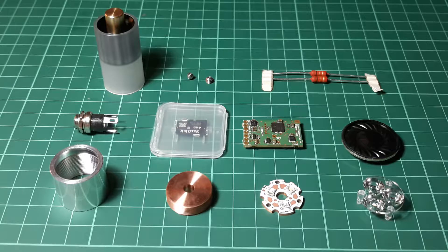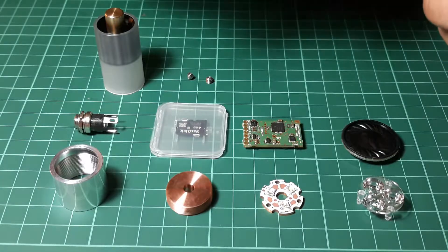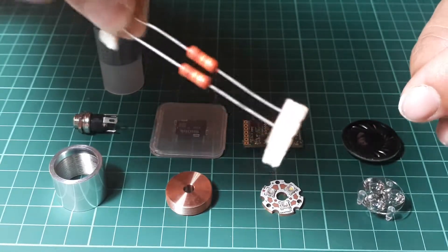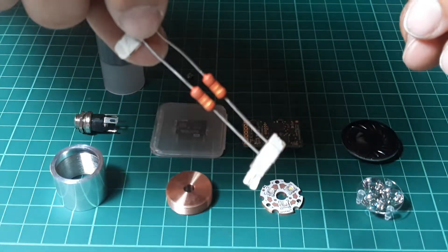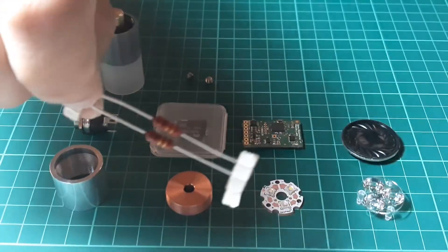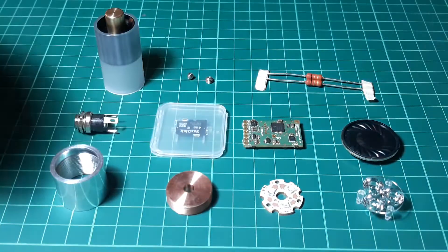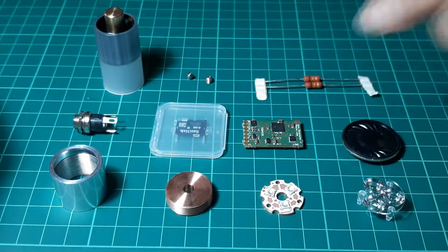So what did I get in the mail from the Custom Saber Shop? Starting from back to front: these are two resistors, 1 ohm 2 watt resistors. They're going to be resisting the dies — the blue and the royal blue dies — so that my LED doesn't overheat. Basically, if I don't use a resistor on both of my dies, the dies will die. That's the how-to-for-dummies physics explanation — I'm really not that good at it, but I'm a rookie who wants to prove I can build a lightsaber.